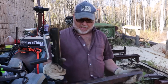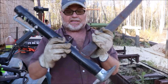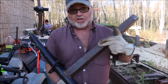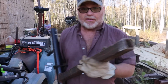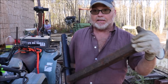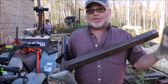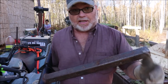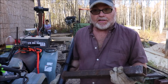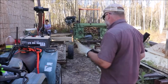So all I did was take a jack like that. Actually, Bert Skelton sent us this jack, so thank you very much, Bert. I welded a piece of this receiver tube that you'd use for a trailer, what you'd put your ball on if you had a pickup truck or something. That's the size, 2-inch. And then I used the outer part, like if you're going to build a tow hitch, like I build a few of them here. I took an outer part and I welded it on the front of the trailer here. So I just slide this in, jack it up, and you'll see the trailer won't tip. You watch how stable this is.